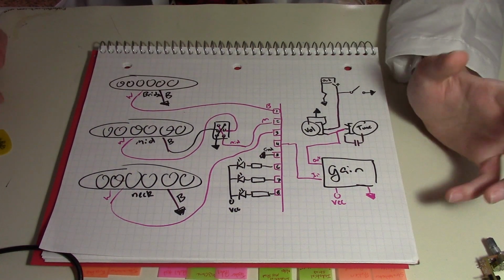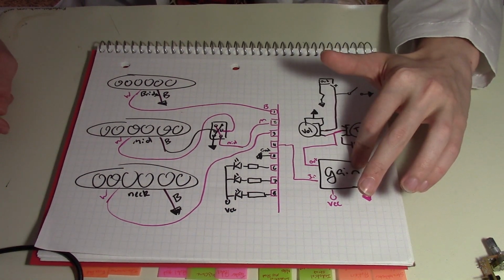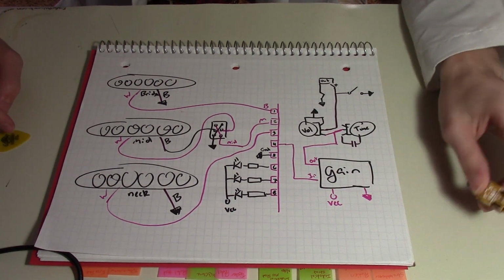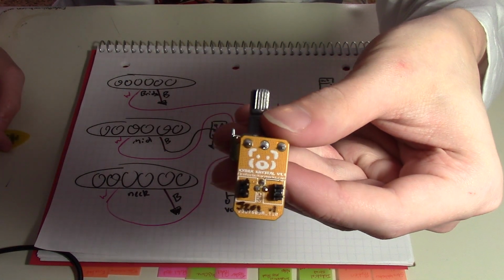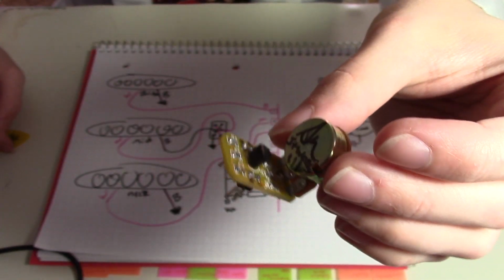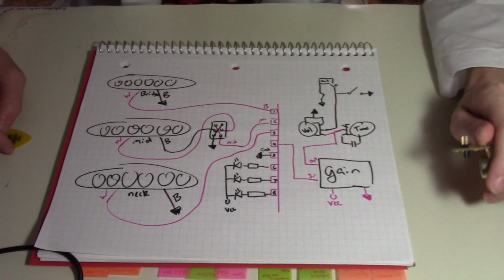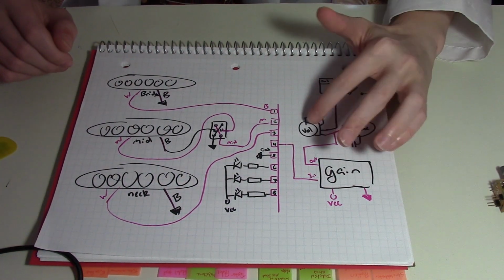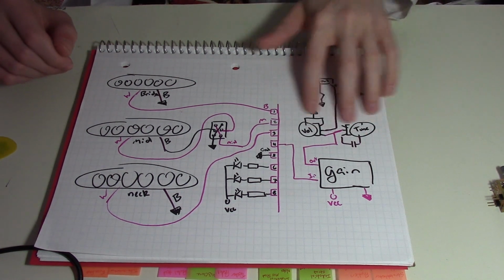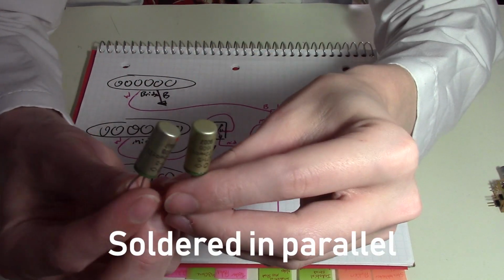Our 5-way selector switch is wired up a little bit differently than what you might expect. And then we have a gain stage here as well. And this is actually a custom little preamp that I designed. Get a close-up on that. And this one's a J201 version. The ones that I am actually using were the 2N5459 transistors. And we'll have a bypass for that. It will go to the volume and the tone potentiometers, nothing special there. I'm using two 220 nanofarad capacitors.